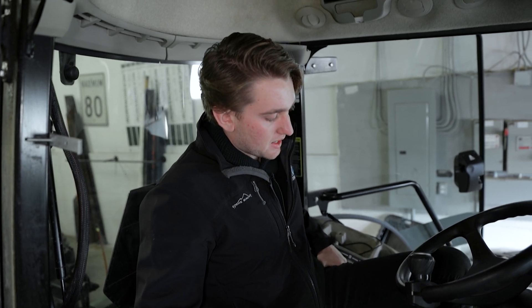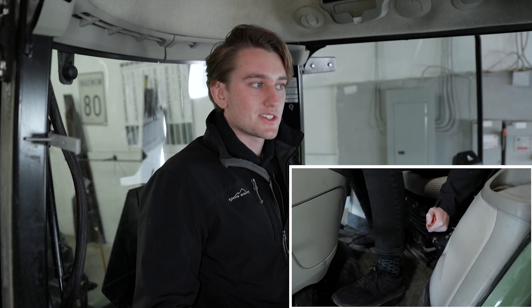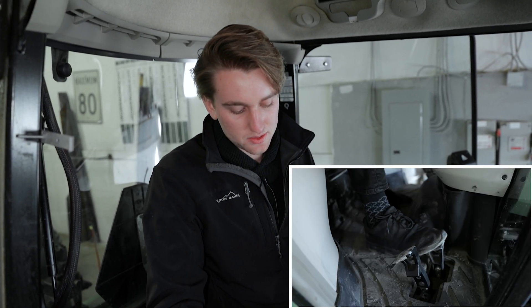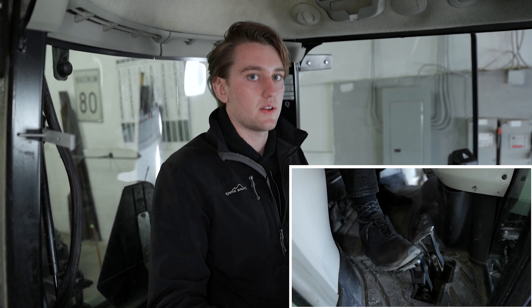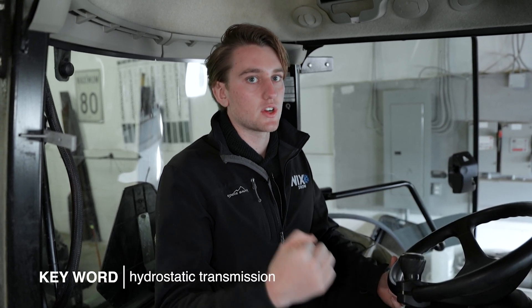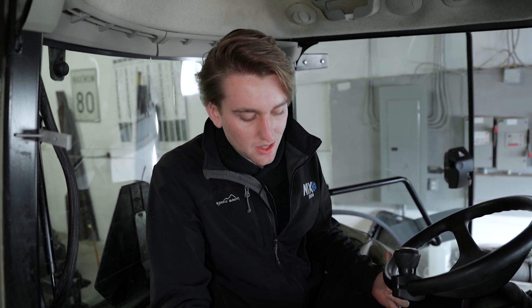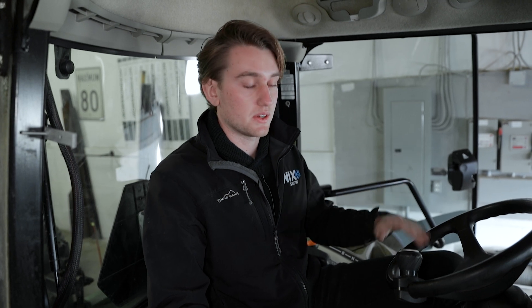On the left side you have your brake here. You're rarely going to touch your brake — only essentially in emergency situations where you stop very quickly. Because your pedals here, you have your forward and reverse, and as soon as you let off the pedal, the machine's going to start to slow down automatically. It's called a hydrostatic transmission, and that means it's driven with hydraulic oil and pumps. As soon as you let off this pedal, you're going to quickly notice it's slowing down. There's really no need to touch the brake unless you have to stop on a dime.